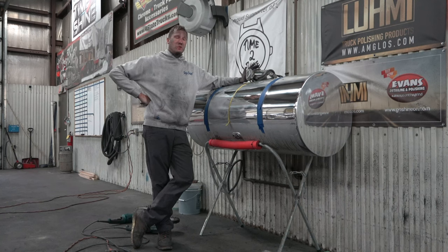Now, if you really wanted to, you could really break this thing down. You could orange and brown, throw a hand polish or mineral spirits or a lacquer thinner on it to clean it, and then go to a yellow and brown, and then clean it again, and then go to a show brown and clean it, and then go to like a show green and finish it out.